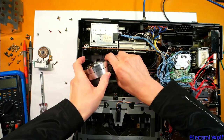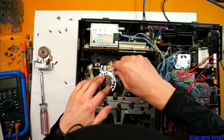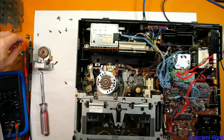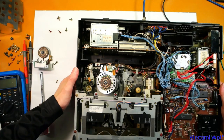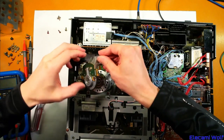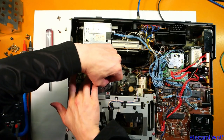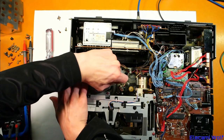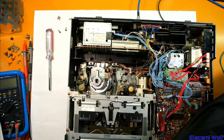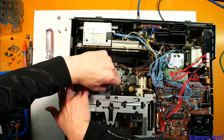Get that positioned so it's not munting the — oh no, it's corroded on that side of the wires. Not as bad though. We'll screw the head in, try not to drop the screws into the machine. That's done up. Just for completeness we'll put back the HiFi audio pickup. Give it a little bit of a wipe just for good luck — I should have done that before putting the top thing back on. It's pretty dirty that head. You just want it not clogged — it doesn't have to be perfect — just so that we can get the best chance of getting a picture out of it.